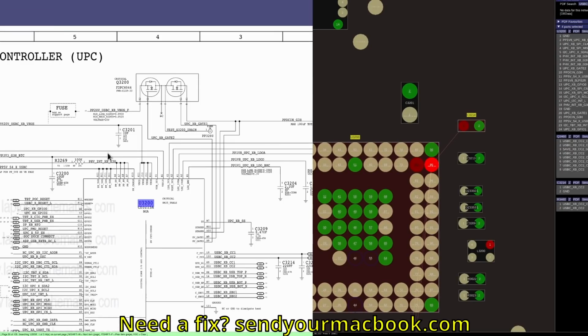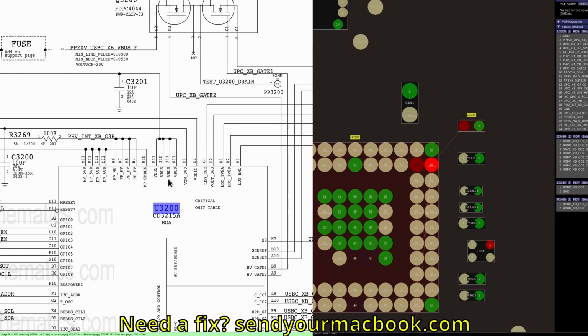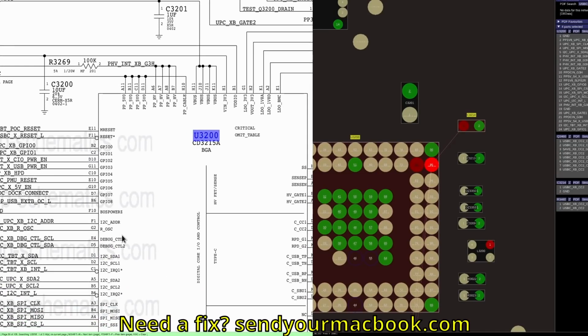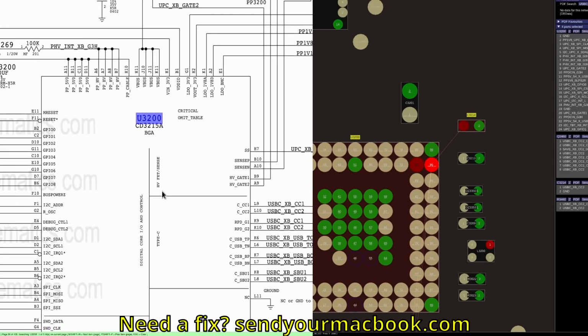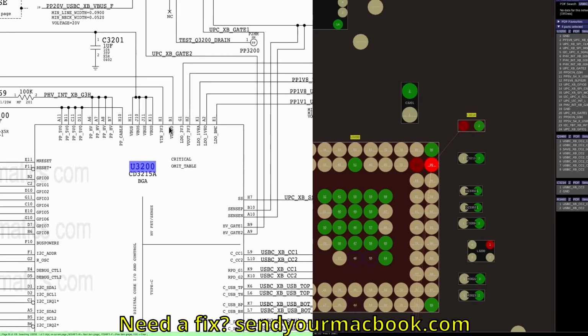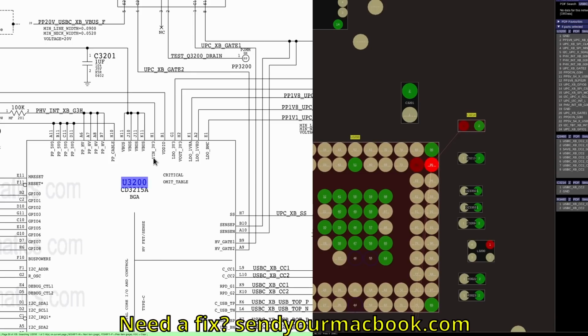And this chip is powered by its input. So over here, you have all these different things: GPIO, I2C, USB TP, and so on. It takes a lot of time to learn what all this stuff is. I2C data line, SPI clock, I know what these things are, but you may not. You kind of have to guess what all these things are. And over here you have VIN. That's not the identification of your vehicle. That is voltage in, what's going to allow it to turn on.